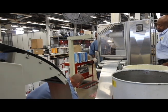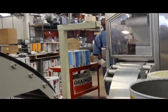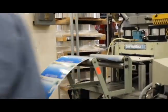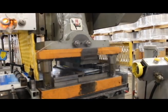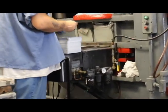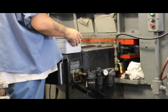The coil goes into a metal straightener to take the imperfections out of it. From there, an applicator applies the sheeting material — because it's a sticker material — to the aluminum. From there, it goes into a 45-ton mechanical press that cuts it out into the shape of the tag and puts the bolt holes in it. From there, the adhesion process takes 24 hours where the blank material has to sit.